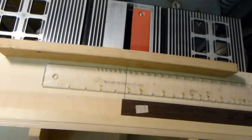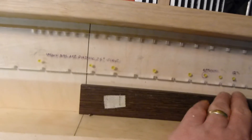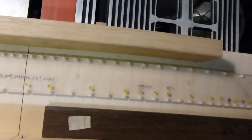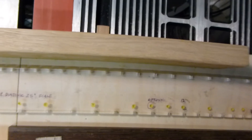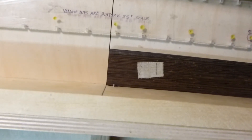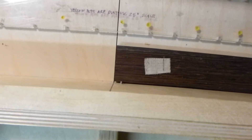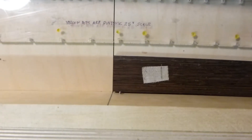If you look right down here, there's a little pin that locates using a template. When you use this, you set it up, and if you're going to do a zero fret or if you want to use a nut, you can set it. I usually bring the saw blade up and run the fretboard right up against it and then go ahead and set my jig.